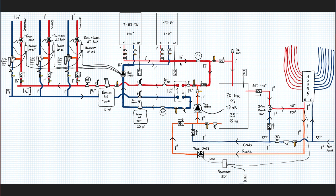With reverse return, the return cold water is reversed from the supply, which ensures equal flow through both units simultaneously. After the output of both units in one inch, we hit the inch-and-a-half tee, come across, and there's a temperature and pressure gauge to keep an eye on the system. Then on one of the first elbows there's another inch-and-a-half by inch-and-a-half by one-inch tee — this is where the hot water will go to supply my 20-gallon stainless steel hot water tank.